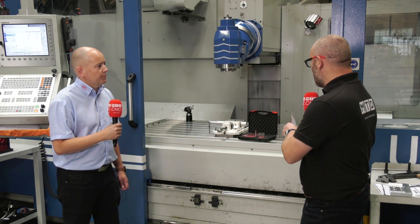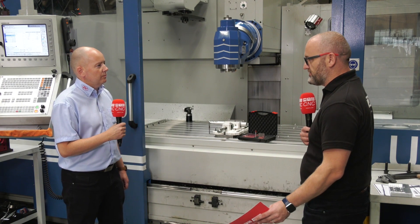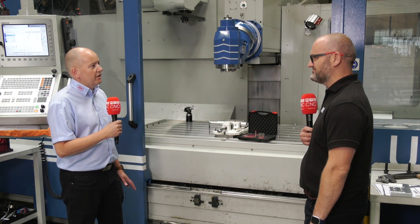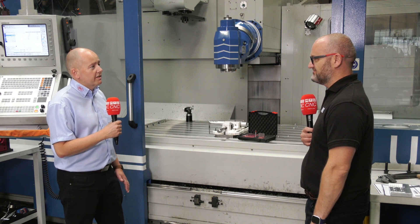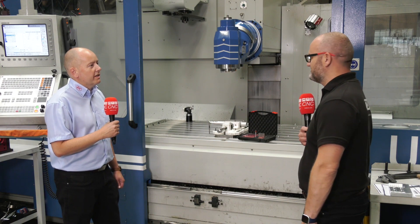The standard tools go down to two millimetres anyway, and then the DL2 now goes from 2.1 down to one millimetre with a unique blade that's also the spring. When you look at the engineering that goes into this, it's incredible. You can use it on slightly rough surfaces and some uneven surfaces, but only slightly on these — obviously because of the size of the tool, being micro tooling. A watch bezel is concave and it was designed to actually deburr that type of hole.